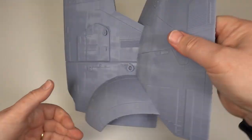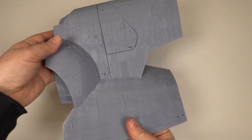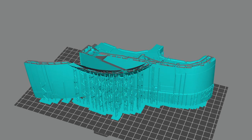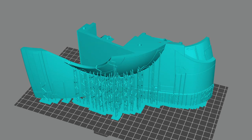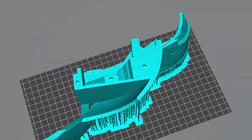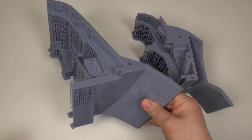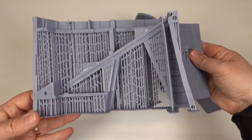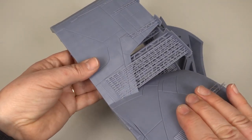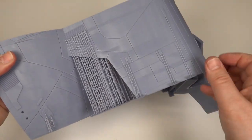After a rethink I decided to remove the outer detail panel and divide the print into two. The original print was the blue, green and yellow parts in the middle — I was now going to print these separately. With the part laying flat on the build plate there should be way less distortion than before. There'd be quite a lot of support material to clean up inside, but better that than a print fail. 24 hours later and I had a successful print, followed by another, and they look like they all fit together. It looks like I have a solution for printing the main parts in resin or on an FDM printer.